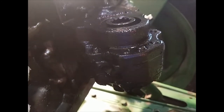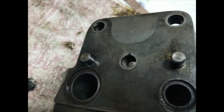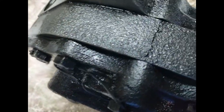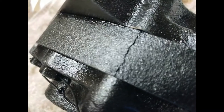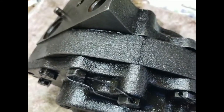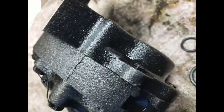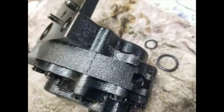We have the pump off. There are three studs and three nuts on the other side of those holes, and two O-rings came out. And there it is — there is a crack in the center plate. We don't really see one on the other side, but it doesn't matter. We need to take these bolts off; they've got lock tie wires on them. The seals are all accounted for, so apparently when it froze, we think it cracked the housing and maybe pushed all four seals out.